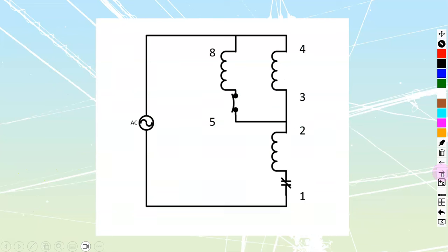Let's talk about the motor and the drum switch itself before we apply them. This is my standard diagram for an AC split phase motor. Each of these is going to be my run windings on terminals one and two, three and four. This is where I would have that optional overload heater that's sometimes built right into the motor — not every motor has this, and this is not the same as the overloads from your control circuit. It's actually built right into the motor, usually seen as a little red push button on the side used to reset it.